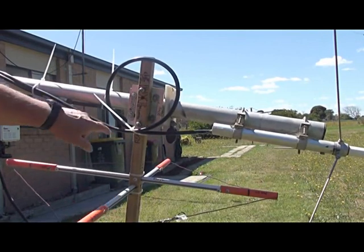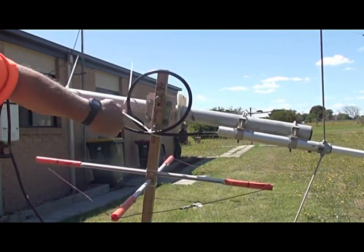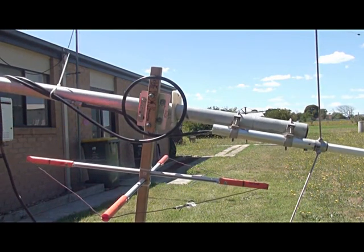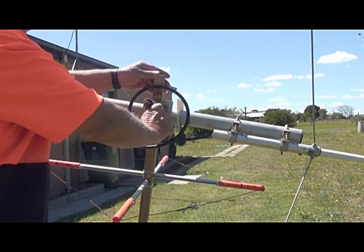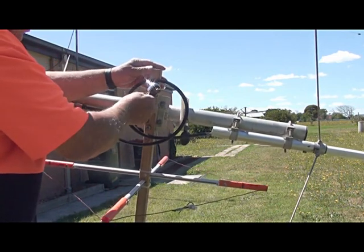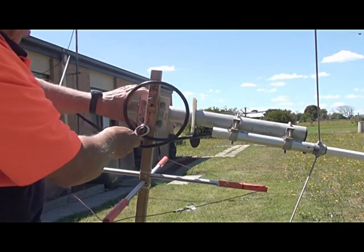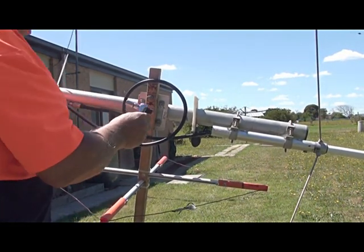This is the balun I'm using on the X200, which comes out of the instructions for mounting that antenna. Here you see the bracket I'm using to hold this quad. So I'm just going to undo these bolts — the way this thing has got some zip ties here — just undo those, and we'll undo those two bolts. That means I can then rotate the boom, which is a bit of wood. I'm going to put some paint on it after this — some spray paint. These are locking stainless steel eight millimeter nuts, and there are fully zinc galvanized bolts holding this wooden boom to this plate, which is bolted with two U-bolts to this aluminum mast, three mil.